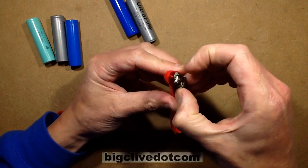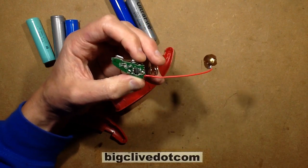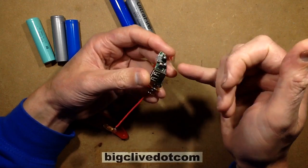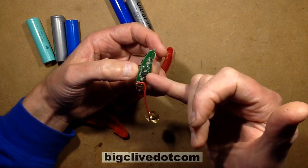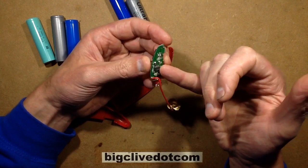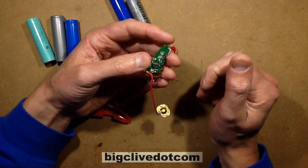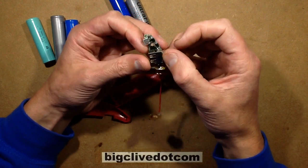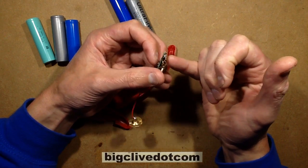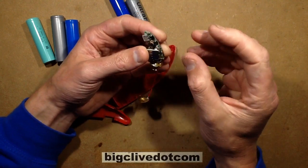The circuit board has been custom designed for the housing. These are just standard universal little 8-pin chips in the standard configuration. You plug it into a USB source of 5 volts and the chip then has a resistive limiter inside, and it charges the cell at about 500 milliamps. On the output side, it's the same chip — it's got the 5-volt threshold detector, it runs the little inductor and bursts to keep that 5 volts up as soon as it detects a load, just keeping the output topped up.